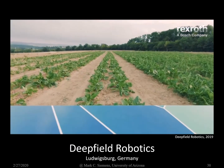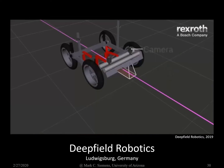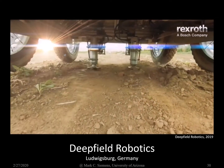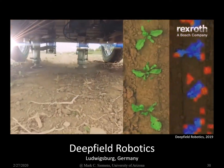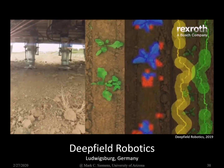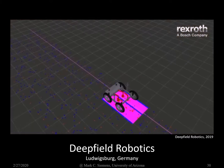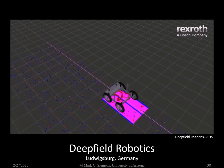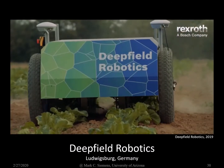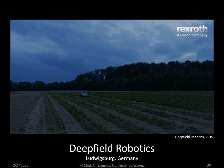The modular solution, using a camera and artificial intelligence, differentiates between crop plants and competing weeds as reliably as humans do. While driving along the sugar beet rows, plants are analyzed in real time. Enabled by precise camera technology and machine learning, an intelligent software distinguishes crop plants from weeds and gives the correct signal for weed removal. Engineers used artificial intelligence to create this ability previously mastered by humans only. Plant recognition works day and night.